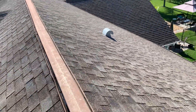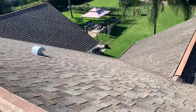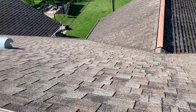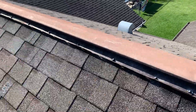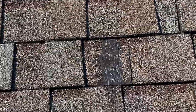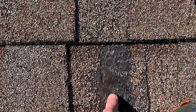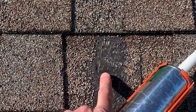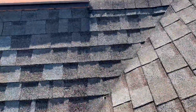The shingles when they're like this quickly become thin and riddled. They don't adhere very well anymore, and they become a risk to the home and to the insurance company insuring the roof system. It doesn't even take but a few, couple, three years. You can see here where this one has the fiberglass showing — the asphalt's evaporated out a couple layers. There's a break in the shingle right there. Be surprised if they don't have a leak there.